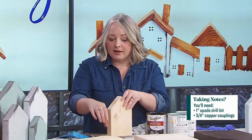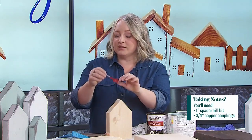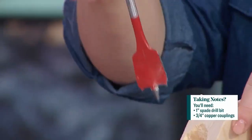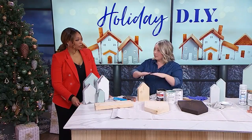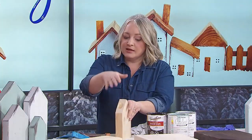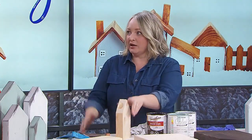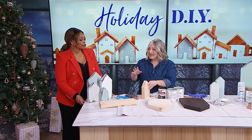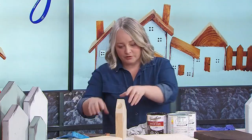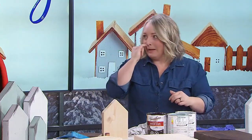When you're using the spade drill bit, you don't just want to leave this on your tabletop and go all willy-nilly with the drill. I have a workbench with horizontal clamps to secure it and drill at a lower height because you're drilling down. You want to make sure you're really safe doing this — it's not hard, but safety first, or it'll fly all over the place.